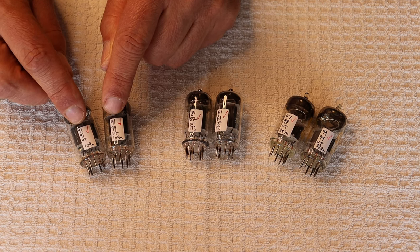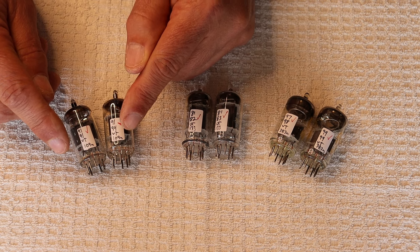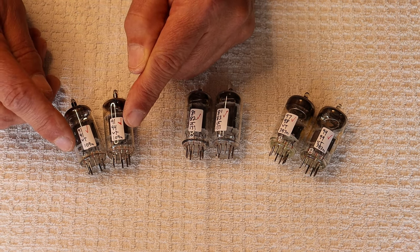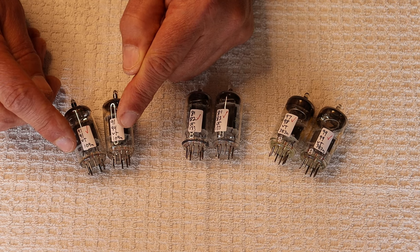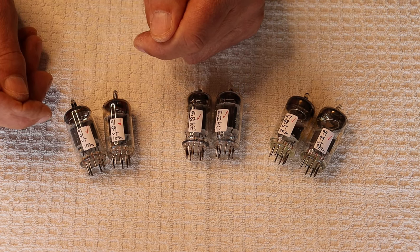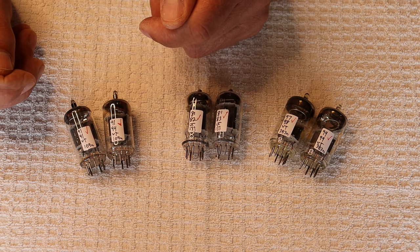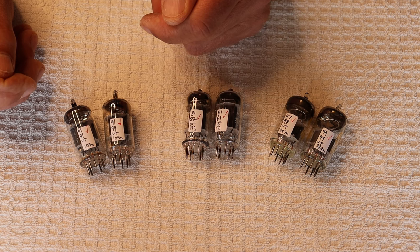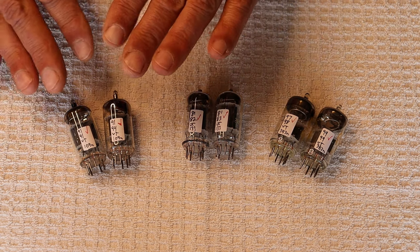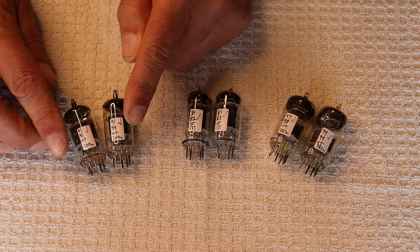Typically 5% or better is what you're looking for in a match. So 91 to 94 is less than 3% difference — that's essentially on the edge of the plus and minus of our testers, which tend to be just under 2%. We run them on Variac, dial in the mains voltage, and recalibrate if anything looks wrong. If tubes are tested in a row, as we tend to do, you'll have less variance and tighter tolerances.